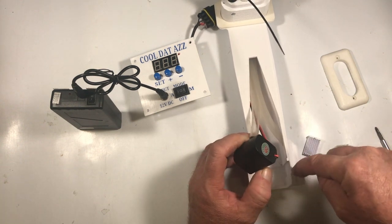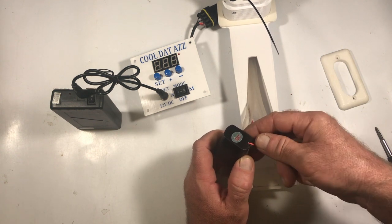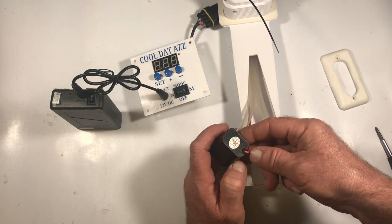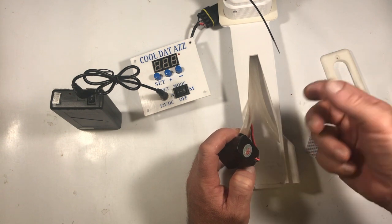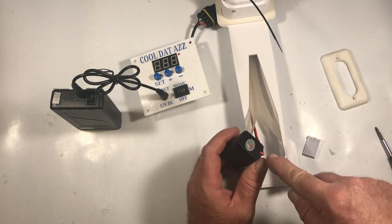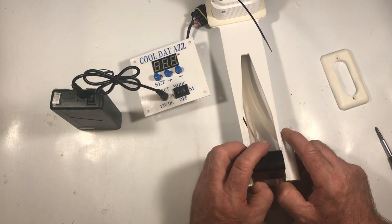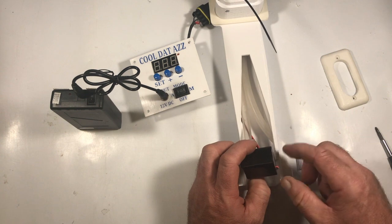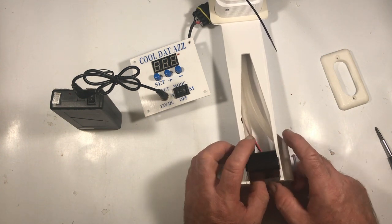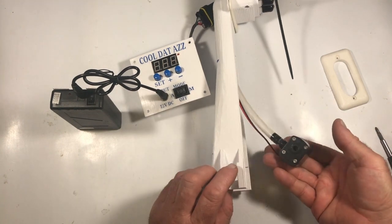If you rub it on that side, or if you try to force it in there, or force it out of there, it can actually wear the insulation off the wire, which won't work if it's got water because it shorts out in the water. So that's a big thing. It's in a bad spot, but we tried to design the pump housings to accommodate that little spot, but you just have to be careful removing that. Other than that, you can see it's pretty simple.